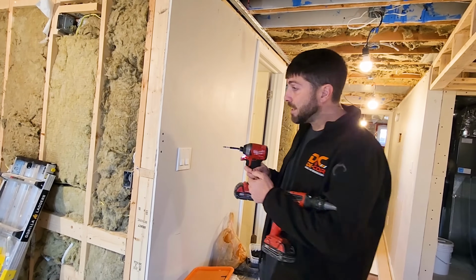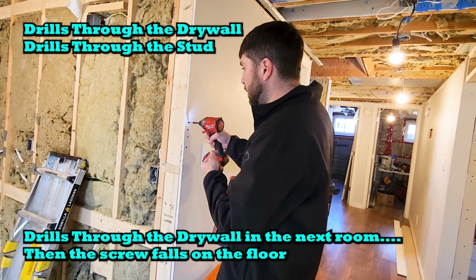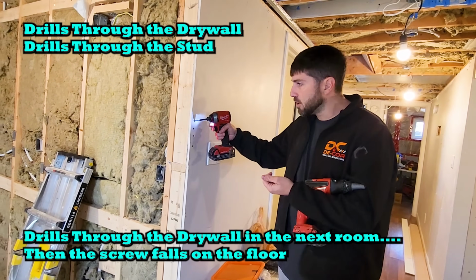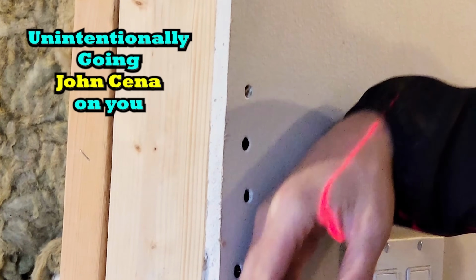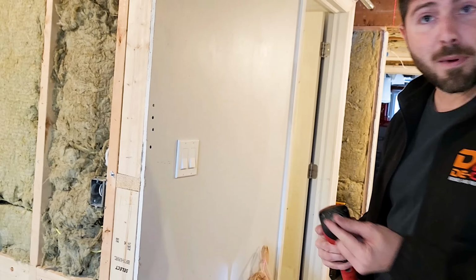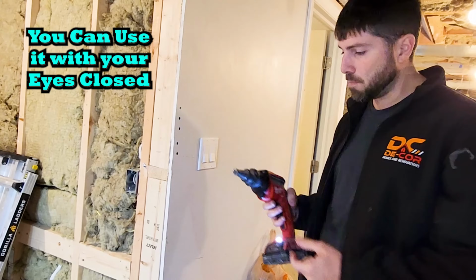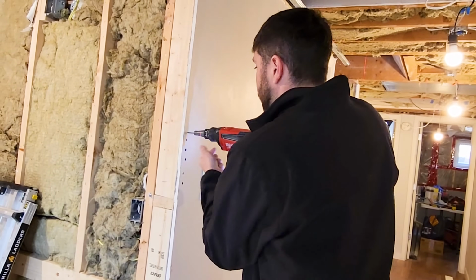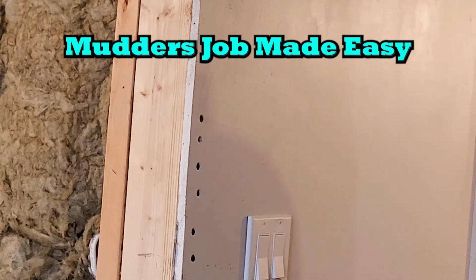But when I see inexperienced people work, they always do this. And they're just going all the way through. They're leaving a giant hole. This is a nightmare to mud because you fill it in, it pours out, fill it in, it pours out, right? Drywall gun, doesn't matter how much experience you have, you push in, it goes maximum speed. Like you could have it so that it's even less shallow than that. Look at this, imagine filling in that hole.